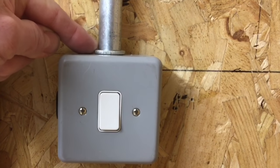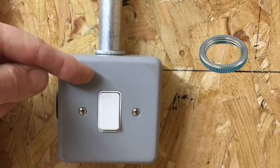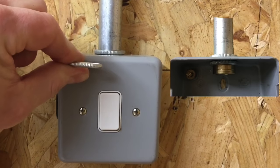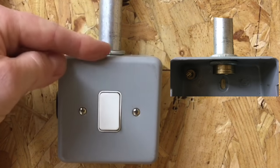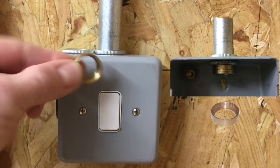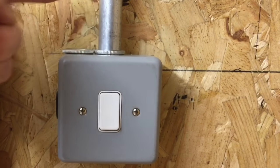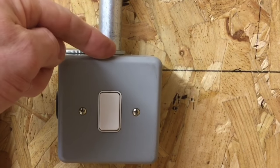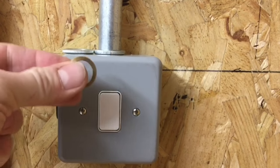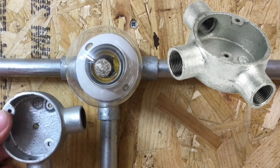On our final switch, we use a slightly different connecting method. On the outside of the threaded conduit there is a lock ring — or lock nut — and a number of threads go into the box, with another lock ring on the inside holding it in place. This fastens the conduit tightly to the box. Where the conduit protrudes into the box, a brass female bush is inserted to stop the cables from chafing as they exit. So: knockout box, 20mm hole, 20mm conduit, lock ring outside, lock ring or nut inside, and a female bush at the cable exit point.